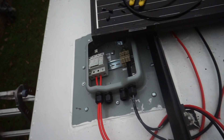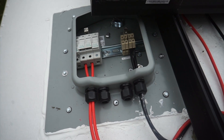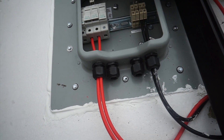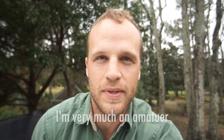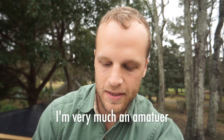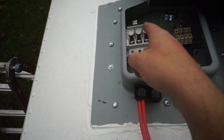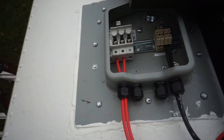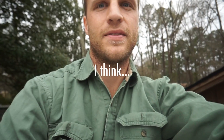I've wired these two first circuits in and I've got one more to do. I don't necessarily do things the most professional way — for example, I don't have wire strippers for 10-gauge stranded so I just used a knife. I want you guys to see the safest, most professional way to do things, but that's not always what I do. I've installed these without any fuses in here — there's no way for electricity to make a complete circuit from the hot lines to the neutrals, so there's really no concern. I'm just working with one side of a circuit.